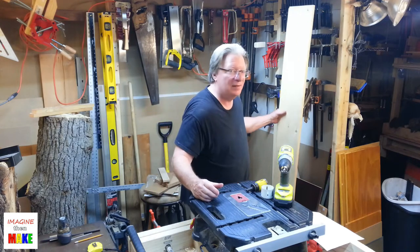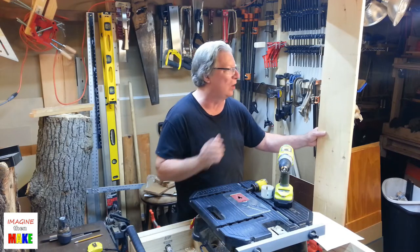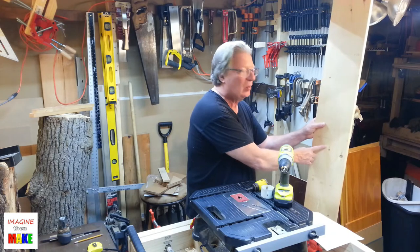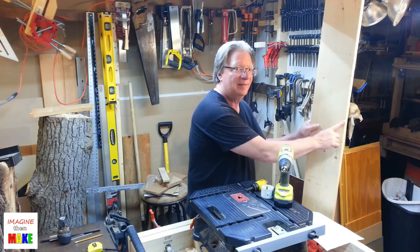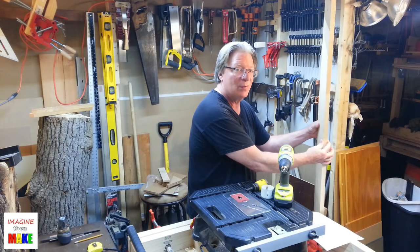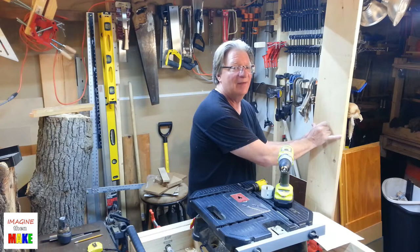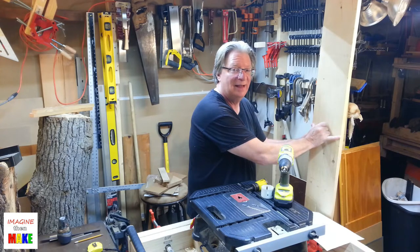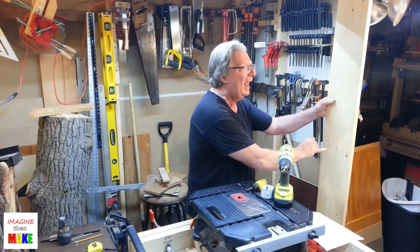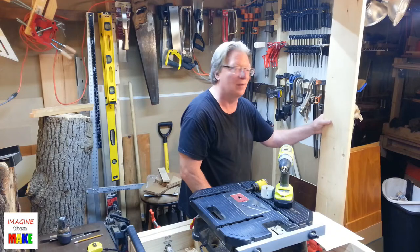So the wood that I'm going to make the project out of is commonly referred to as common board. Now, common board comes in all different widths and lengths, but as far as I know, it's all the same thickness. So this particular board that I have is known as a 1x8. Those are the nominal dimensions. The 1 part, the thickness of the board, actually measures 3/4 of an inch. And the 8 part represents the width, and this actually measures something less than 7.5 inches, so considerably less than 8 inches. And this particular board is a little over 6 feet long. Like I said, they come in different widths and lengths, and it's fairly inexpensive. I paid about $11 at the big box store for this piece of wood.